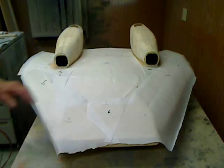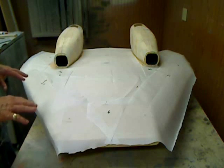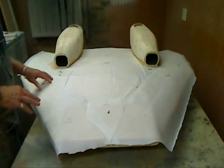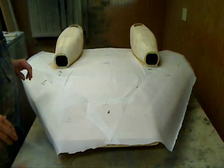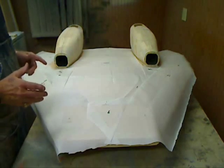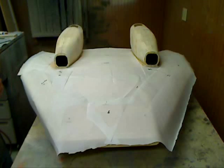This is just a short little clip to show you what I've done with the peel ply. I've got it cut up into sections so everything lays according to the compound curves. Everything is numbered and marked, hopefully in the order of them. I'll put it on once I get the fiberglass on, and we'll see if we can get it to lay down properly this time without getting ourselves in trouble. I do have one big piece in the center that I'm going to try and put on by myself, so I'll fold that up and hopefully fold it out as we go.